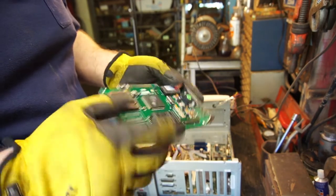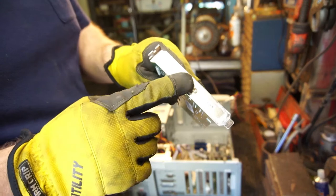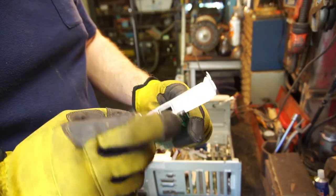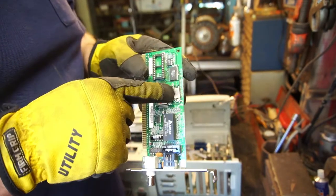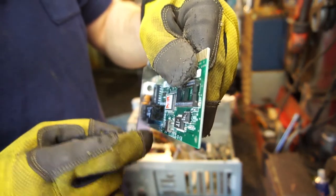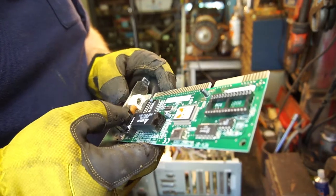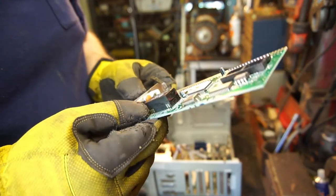on the pins there. No gold plating on the back, but there's gold fingers there. There'll be gold in these pins. Same story here. Always nice gold pins in the Cat5 connection. There's a more technical term for it, I can't remember. Another not a crystal oscillator, it has the two pins. Crystal oscillators have four connections. That just has two, so it's just a crystal. And there's a couple MLCCs there, a couple dip capacitors. I'm not exactly sure what those are, but I'll save them anyway.